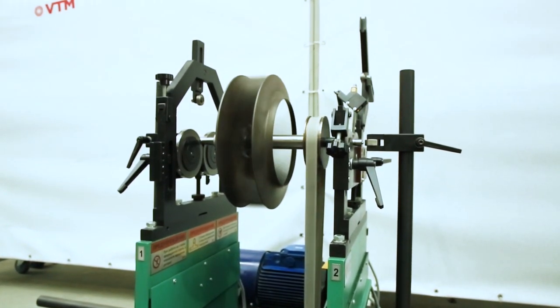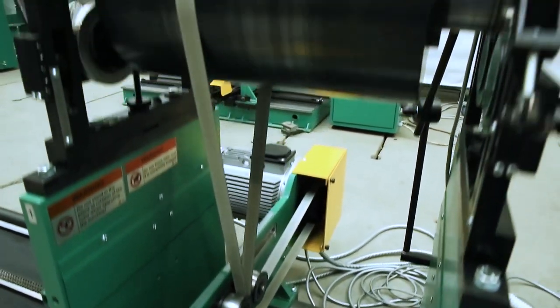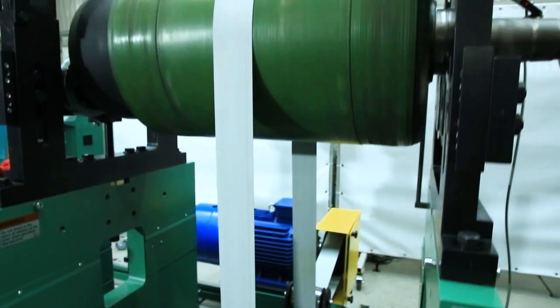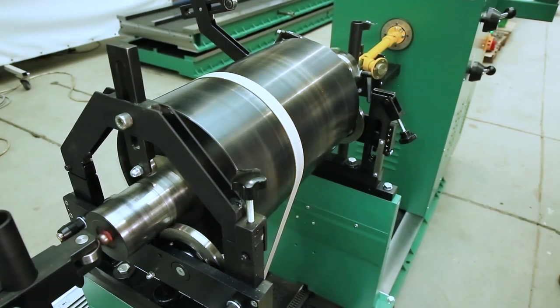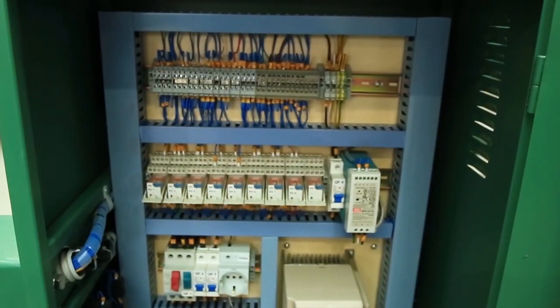The advantage of the application is narrow supports and the ability to install a rotor of various designs. It is possible to balance the rotor with a large initial imbalance at a low speed. The design of the machine software allows for safe balancing of the rotors in their own bearings. Additional equipment of the machine with balancing mandrels or devices expands the technological capabilities of the machine.